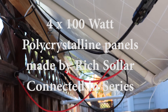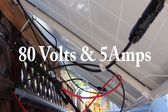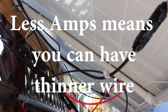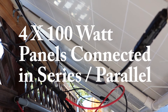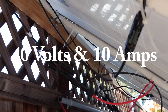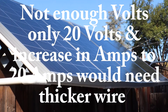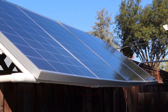When I first did this setup I originally had all four panels connected in series, which was giving me 80 volts and 5 amps at the solar charger. Lower amps means you can use thinner wire, but I was concerned about shading on the panels, so I went with a compromise using a series-parallel connection. Connecting in series-parallel still provides 400 watts of power and meets the requirements of my solar charger at 40 volts and 10 amps. Having all four panels in parallel would have needed much thicker wire and wouldn't have provided sufficient voltage at the solar charger.